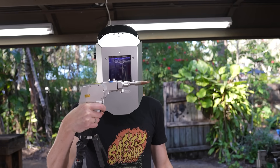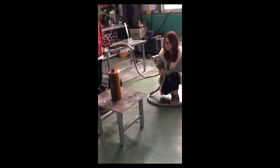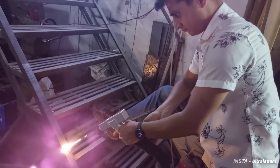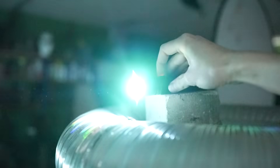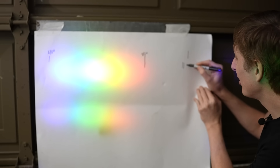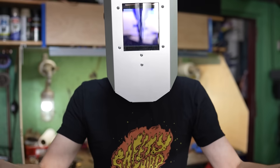So when I pull the trigger and turn on the laser, how come there's no beam? It's because it's invisible. I'm talking about all of these people that are using this type of laser without any eye protection at all. People aren't worried about it because they can't see it. Our eyes can see light from about 400 to 800 nanometers, but this laser operates way over here at 1,100 nanometers — far out of the visible range. Always wear your eye protection, because with this laser, you won't get a second chance.